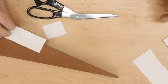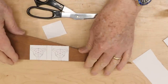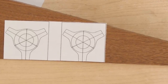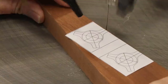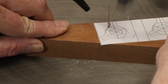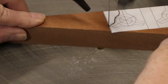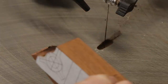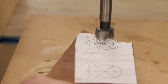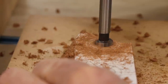I didn't want to have to get a wrench every time I used this extension, so I made three-sided wooden knobs. You can buy knobs like this, but my hobby is making stuff. The wood is a scrap of 22mm mahogany, which the scroll saw usually handles with ease. This time, my blade was clearly dull and started burning the wood, so I stopped. I also remembered belatedly that it would be much easier to drill the hole for the bolt head before I cut the knobs out.